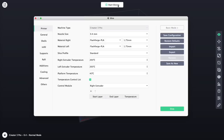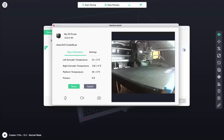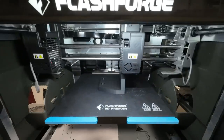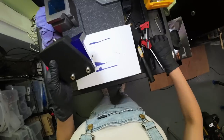This is another handy trick. I can design the piece I want to make in CAD and then 3D print a template that I can use to scribe the lines I need to cut on my workpiece. It's not very precise machining, but it's fine for this.